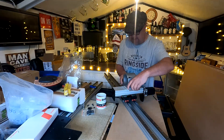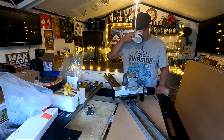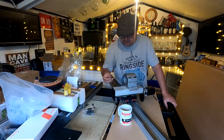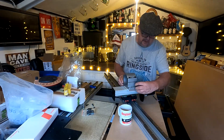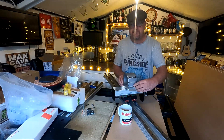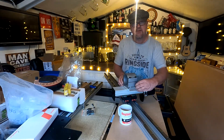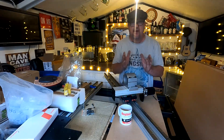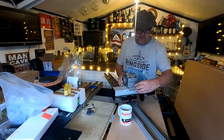This will then screw onto there. The 6mm cap-heads will bolt up through there. I've not doweled it or pinned it because I'm going to have to tighten it right up tight. I don't want it moving, but I want a little bit of movement with the cap-head screws so I can clock it up and tram it — get it running parallel to the spoil board.